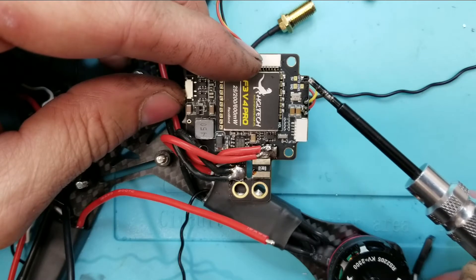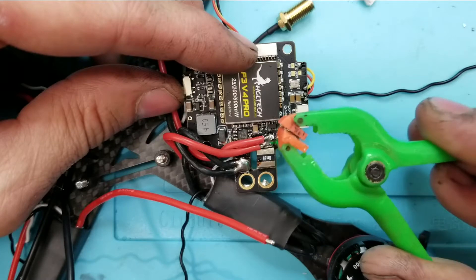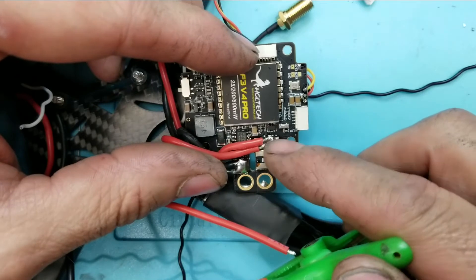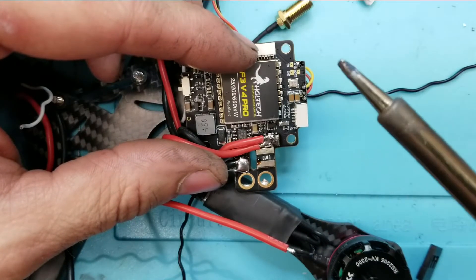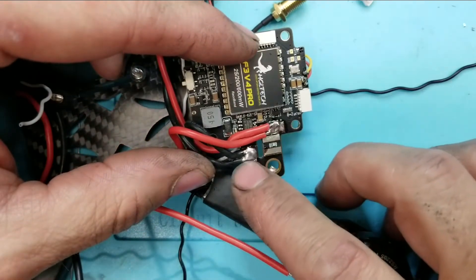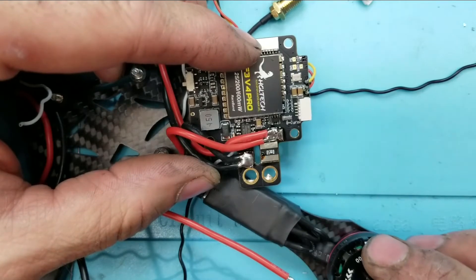You want to put your smart port right here if you have an FrSky receiver. This is kind of a headache to hold all this stuff, so I got these little clamps — I think I got these at the dollar store a long time ago. They don't have much spring, but I clamped the wires down and soldered, making sure there was no rosin going onto the board. I changed to a big fat soldering tip and turned my station up to 450 degrees Celsius to get nice, shiny solder joints with lots of heat.